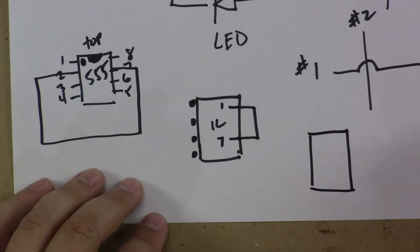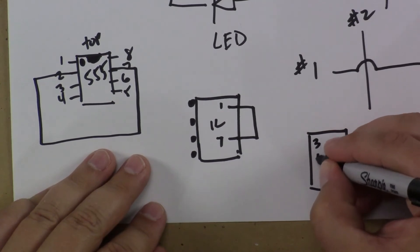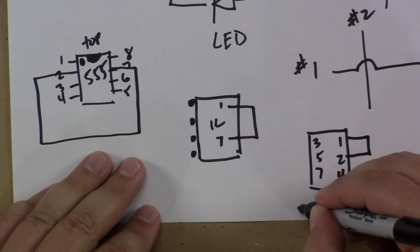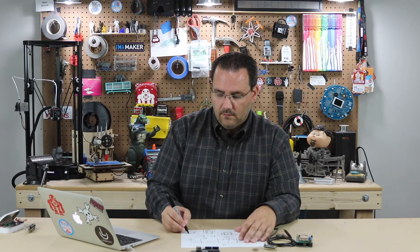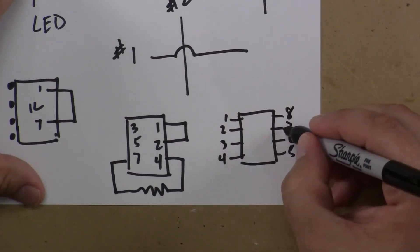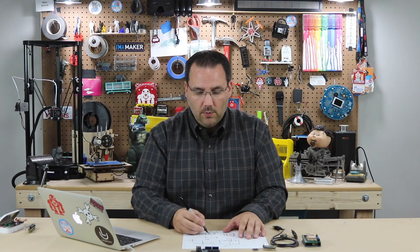So if I had an eight-pin microcontroller, timer, or whatever it is, I might see on the inside pins three, five, seven, one, two, and four arranged in any order. And you might see a diagram where pin four is connected to pin seven, even though on the actual microcontroller it would look quite different. Something to keep an eye out for: make sure you read what pins are going to what part of the integrated circuit.